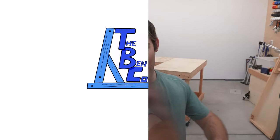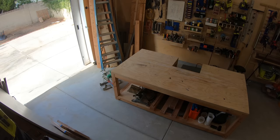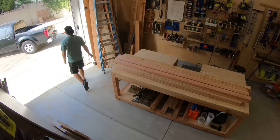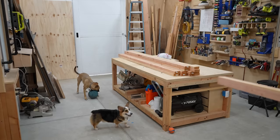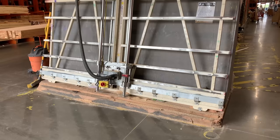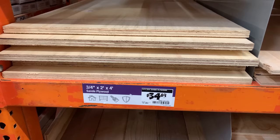There are detailed plans for this on my website. I designed this to be as easy as possible to build, so it's made out of only a handful of materials and can be assembled with just a few tools. The main materials required are three-quarter-inch plywood, two-by-fours, screws, and casters. The tools needed are a drill, three-quarter-inch spade bit, measuring tape, pencil, speed square, and some way to rip down the plywood. A circular saw or jigsaw will do the trick. If transporting large sheets of plywood isn't an option, most big box stores have a panel saw and can rip sheets down to size, or they may have pre-cut sheets already for sale.